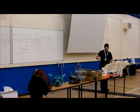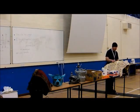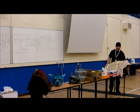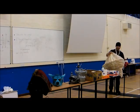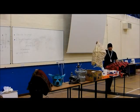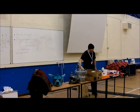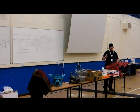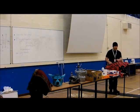Other than polyurethane, you can cast with fiberglass, and that's what I did with this. This is why I did a latex mould for this as well. Latex is dead cheap. If it all went wrong, I wouldn't be opening my wrists because I just spent probably 500 quid to make a mould. Spent 20 quid to make a mould, a lot cheaper. So yeah, so... Silicon, that would be very expensive, is that what you're saying? Silicon is extraordinarily expensive, but you get the best results from it.